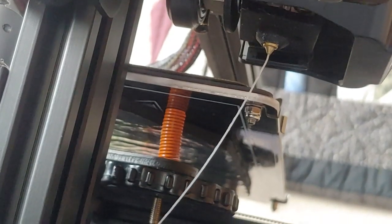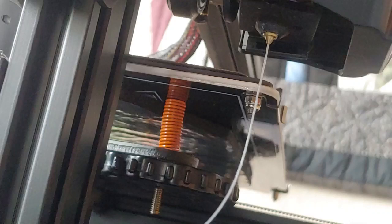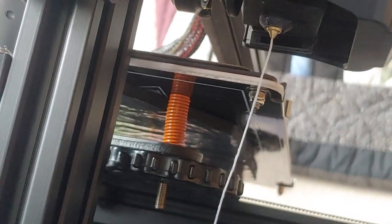With the white filament you can kind of see it go through. Keep doing that and see what oozes out the tip. It should be reaching the hot nozzle — there it goes. If you were to hear the extruder click, it means something's blocked in there, but this is coming out pretty well. I think I cleared the nozzle or whatever was stopping the extrusion from happening.